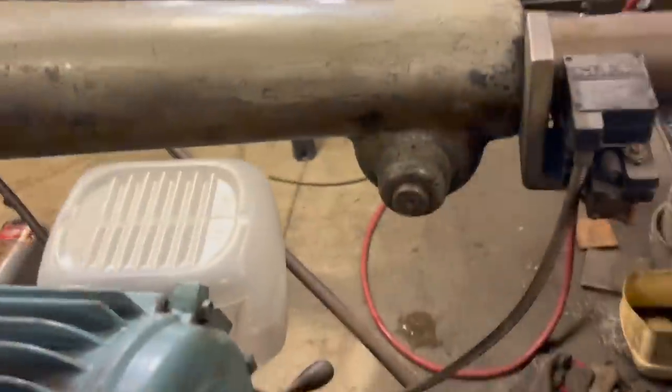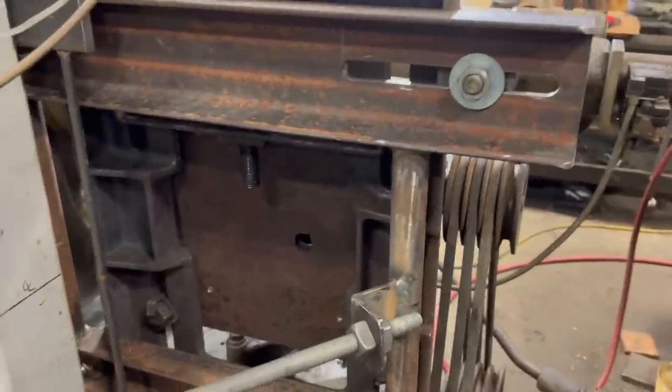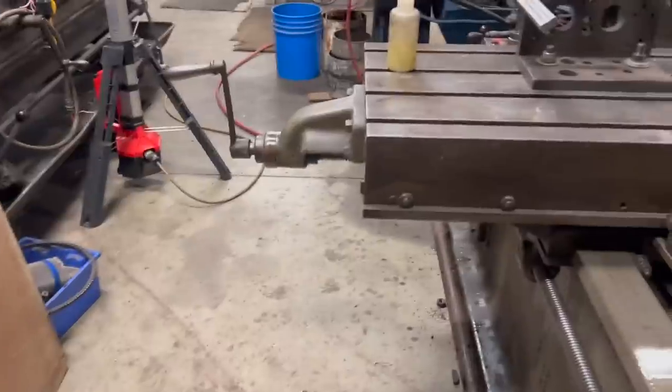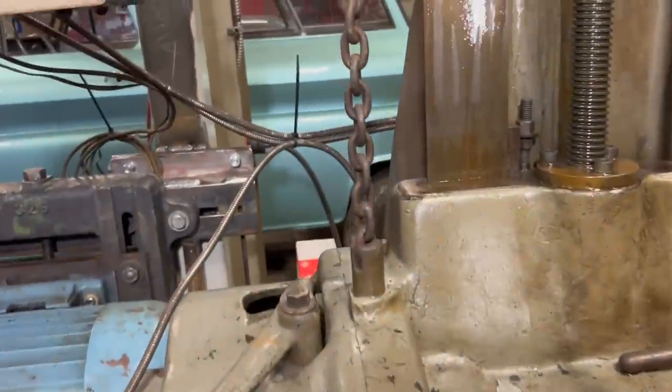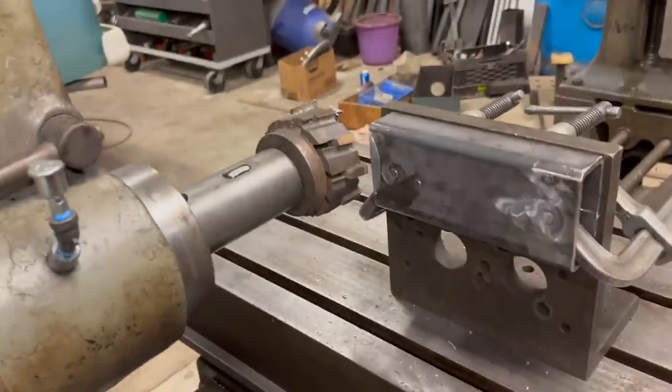I had enough travel with the slide and longitudinally. I was worried about yaw in the motor conflicting the belts and it really wasn't a problem. We've got the electronics on it. Basically it's all bolted down — long story short, we're rigged up. This machine came to me with an electronics package and we put that on for the first time about an hour ago and it came to life and it works. We've got a shell mill in there — probably a five-and-a-half or six-inch shell mill from the pile of stuff that came with it.